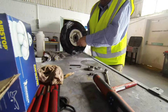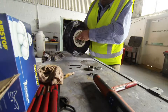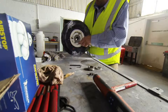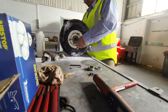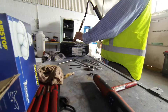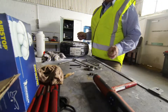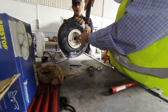Stick with Cleveland, they'll always make you happy. We're just looking for a little bit of thread popping out the other side of the bolt, because we don't want to do the wheel halves up too tight - we don't want to pinch the tube. There's a little trick that Daryl's taught me to prevent that, which you won't find written in the manuals but you learn after years of experience: we inflate the tube a little bit, just enough to get some pressure in so the tube won't be pinched by the two halves.